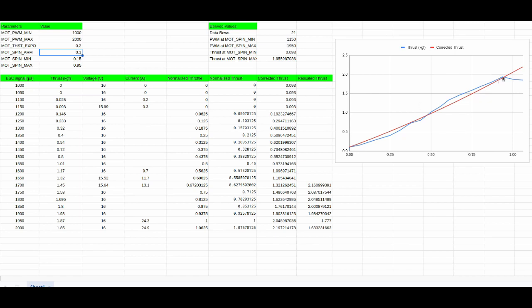One of the other things we can see here is that above about 90% the thrust peaks — that's why the ArduPilot default is that the maximum demanded thrust is 95%. Regarding the minimum spin, anything below 10% throttle this particular motor didn't spin at all, so in practice I'd probably increase that a little just to make sure the motor is definitely going to spin up.